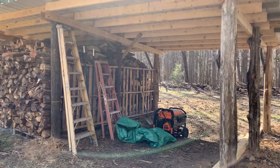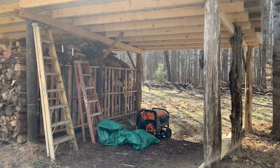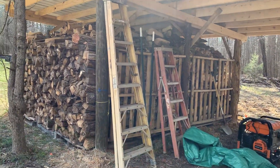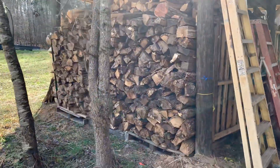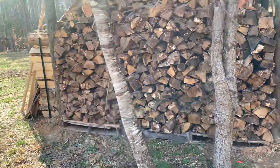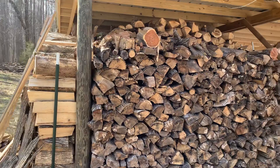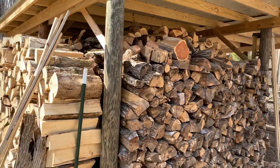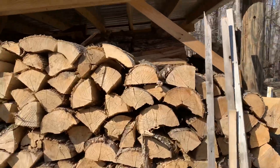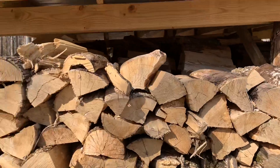You can see I used some recycled telephone poles. I've got some cedar posts here. I used pallet skids and reinforced them. You will also notice that I've got all of my wood on pallets — that gets good airflow underneath. I also spaced the wood stacks by about six to ten inches where it made sense, in some cases maybe even four inches, just to get some good airflow in between the stacks.